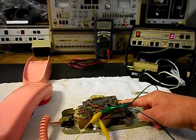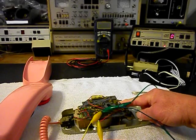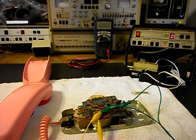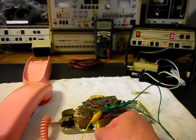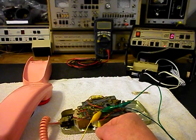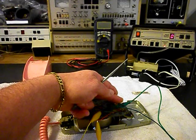That red light on the analyzer should go out. If I pull this jumper, it does hang up. I just put the jumper back and it sees the analyzer again — this is exactly what he was experiencing at his home. We want to listen for static again. When I clamp onto the wire, you can actually hear it pull the dial tone down.